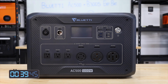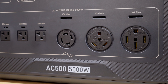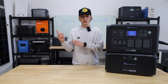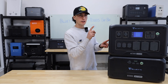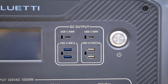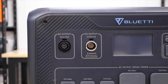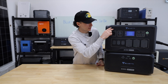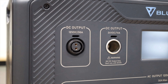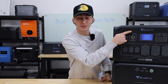On the front of the inverter we have three 20-amp max plugs, a 30-amp max plug, a 30-amp L14, and a 50-amp max — which is interesting because this is a 120-volt unit and you need two to run 240. So having one 240-volt plug on this that doesn't actually run 240 is weird. There are also two USB-Cs, four USB-As, another 12-volt with a weird extension cable-type adapter, and beside it a 24-volt plug — so if you plug 12-volt accessories into that, you're setting them on fire.